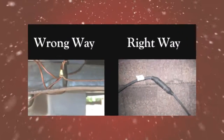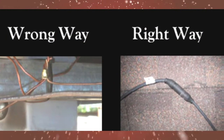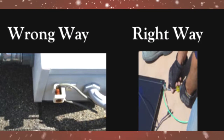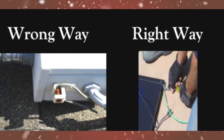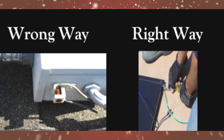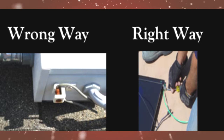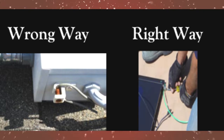Make sure your wire connections are properly installed. The new plug-and-play wire systems help solve this problem and work well. The selection of your electrical materials — the lugs, the screws, the wires, etc. — is critical for a safe and durable system. In the picture on the left, indoor-rated materials were used for the outdoor grounding applications on the panel itself.